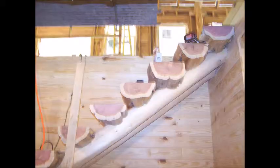You can see looking in from the side, I think it looks better to have the steps notched and not the log notch in this instance. The cedar steps have a lot of ununiformity to them with the live edge, so it's really hard to get a good clean notch in the stringers. Plus, you'd be cutting out a lot of stringer at any given time, and we just don't want to weaken them like that for this set of stairs.